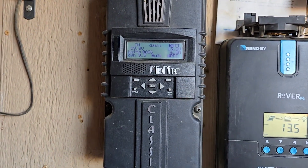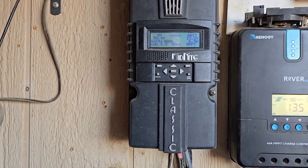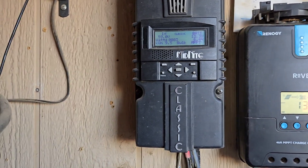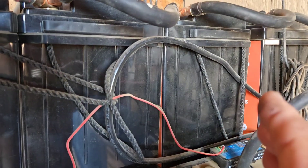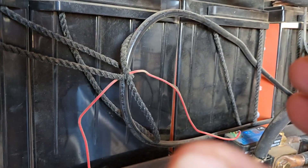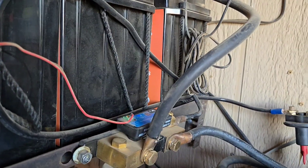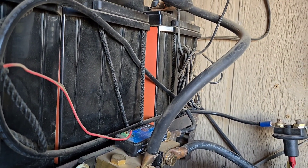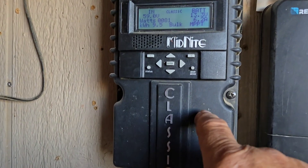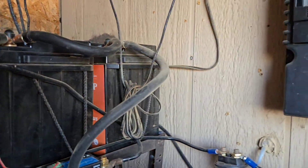You can end up ruining the Midnight Classic — it won't carry that load. So you've got to come up with a better idea. That's why I've been pushing the idea of all-in-ones. The all-in-ones are designed to handle the extra power that these LiFePO4 batteries demand, because these are running on 200-amp BMS's. There's a capability of 200 amps going through these things.